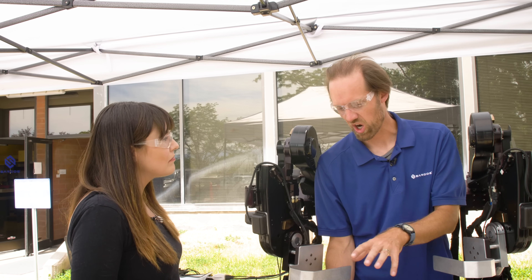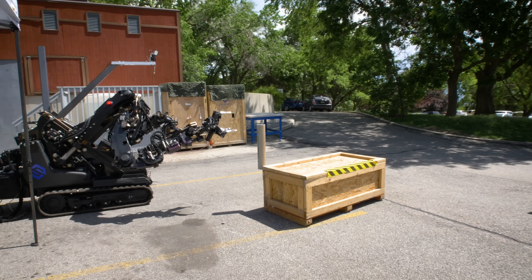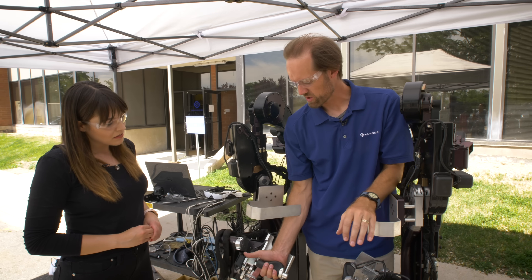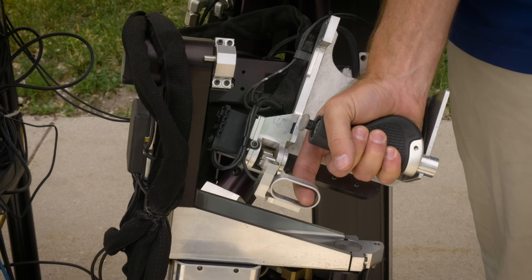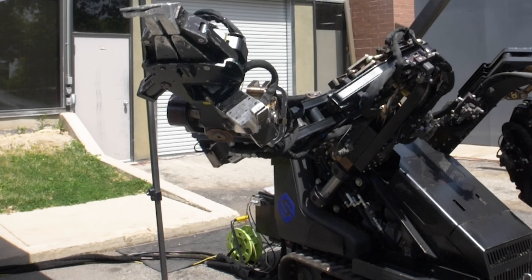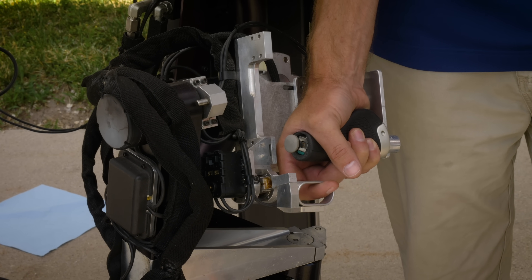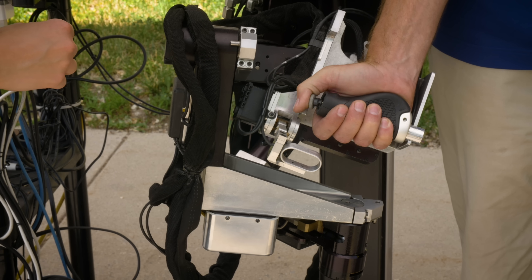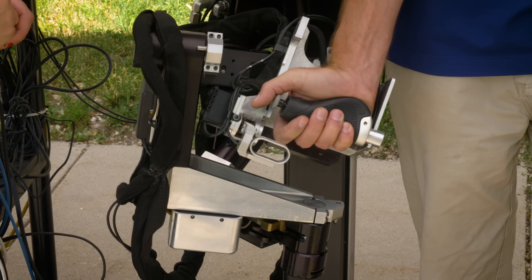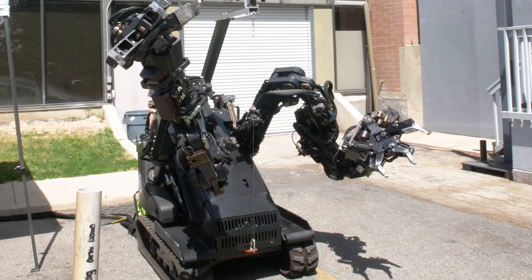Now it's my turn. Because it's my first time I won't get to use the saw, unfortunately, but I will get to try to lift this metal pipe off the cylinder and put it back on. Moving the hand's position is all you've got to do — just move your hand where you want it to go. The controls for the gripper are down here. This trigger finger will control the thumb of the gripper: when it's all the way out, the thumb is all the way open; as you squeeze it, it swings around and starts to close. This joystick up here, used with your thumb, will control the width of the fingers. So in short, you use your finger to control the thumb and your thumb to control the fingers. I'll only have the right arm — the left arm will be locked.